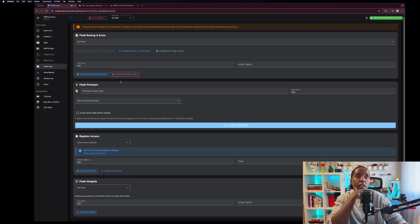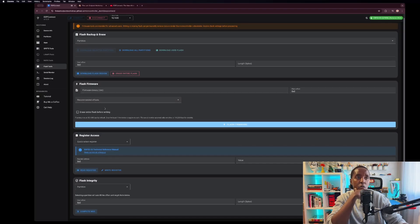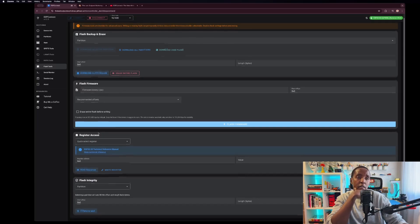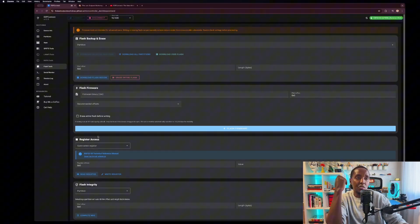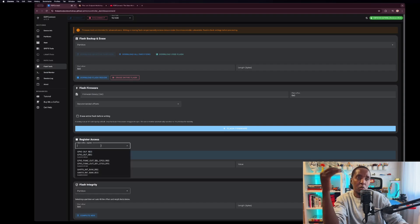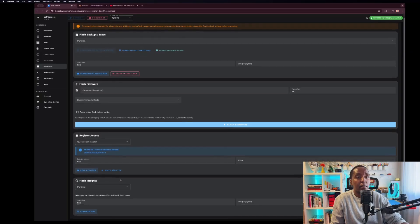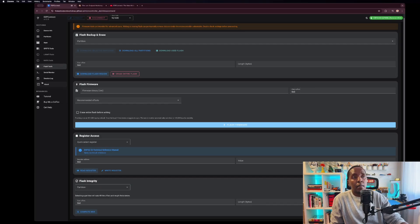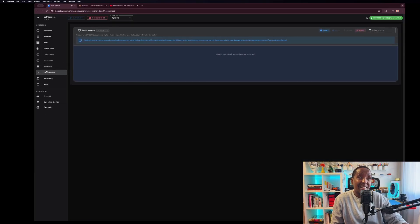Once you come to the flash mode, you can erase the entire flash, download whatever parts you want, and if you're writing you can erase the flash before writing. This gives a lot of freedom to go back and add your code and your systems. You can also download particular sections of your SPIFFS or partitions, and then read and write the registers, manage partitions, and other things I haven't even gotten to yet.